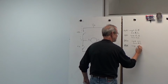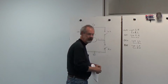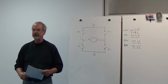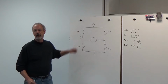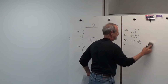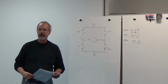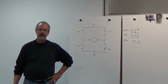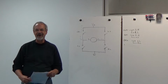We're going to have both high sides. Will that give you braking? Yeah. Essentially, when you're using the braking to charge the motor. No, that configuration won't charge the motor. This one will not? No, something's wrong. Think about it. There's no path between the battery, there's a path between ground and V+. If you drew that over there, there's no path in that configuration. So something's wrong. As I say, it's never used in robotics, so maybe that's why.